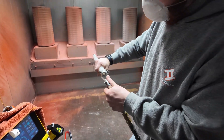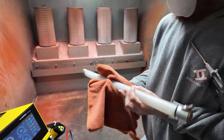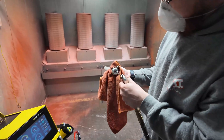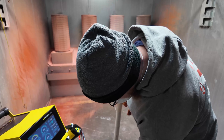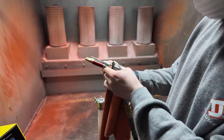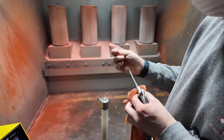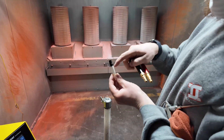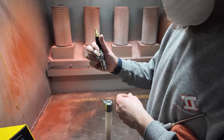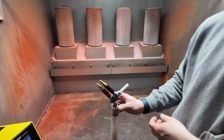Take the pickup tube and blow it out. If there's any residue, take a rag and wipe it down, then blow it off one more time and set it back in place. Next will be the spray pump — the Venturi tube. The Venturi tube is slotted, so make sure you align the pieces and they'll fit right in. Take the holding piece, push it back, and now it's locked into place.